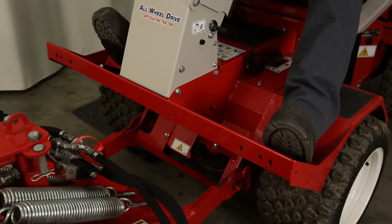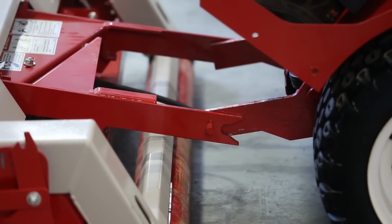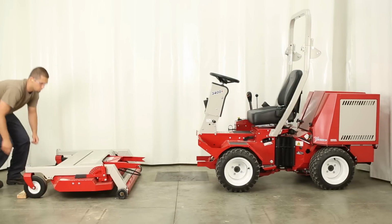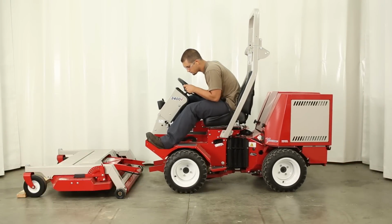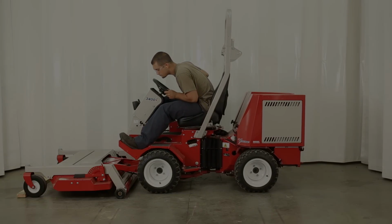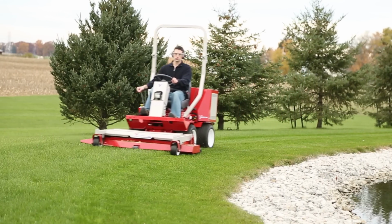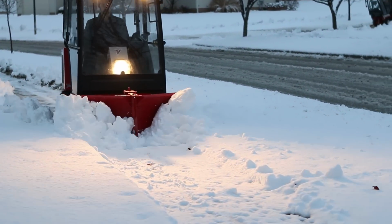Also, many Ventrac attachments have wheels on the front which allows the attachment to roll forward as shown here. When attempting to engage the hitch, it is best to block the wheels to keep the attachment from rolling forward. It may also be helpful to observe an experienced operator attach the attachment to see the proper sequence taking place. We will demonstrate attaching a 3400 tractor to an LM600 mower deck and a KV552 V-blade.